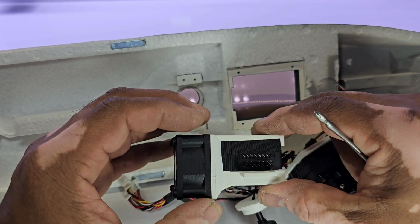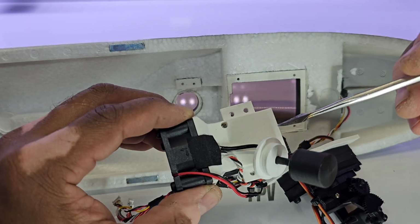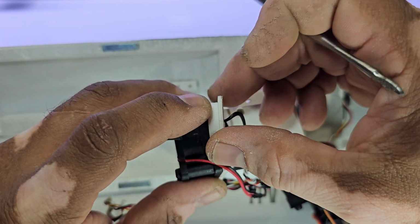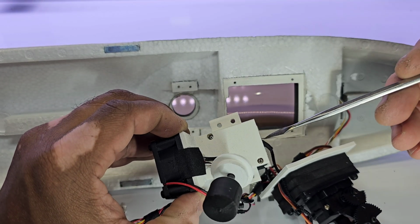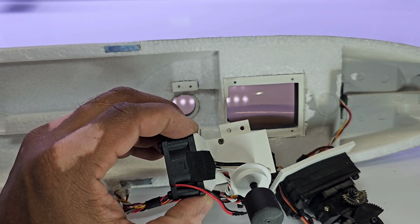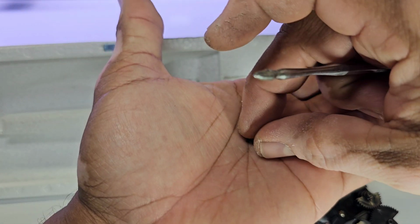Now, the way the air unit mounts to the duct is, you'll see here, it's kind of hard to see, but there's some small screws here, right? They're diagonal. So there's 2 screw points. So what you would do is you would take the original screws that came with the air unit out on 2 spots. And then once those screws are out, you would need to use M1.6 by 10 millimeter screws. So oh, that's not it right here. Let me get the right one.